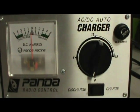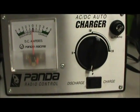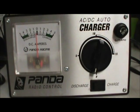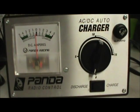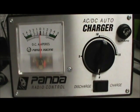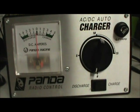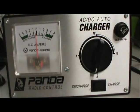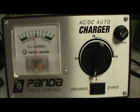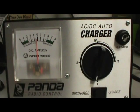The discharge and the charge. Anyways, this is what you can use if you have one of these kicking around, or even a plain adapter. I originally used an adapter — maybe a 12 volt, 1 amp adapter — and just put two alligator clips on it. If you don't have them in color coordination, just whatever starts bubbling is the item that's cleaning. So if your coin bubbles, you're doing the right thing. If it doesn't bubble and the fork bubbles, it's reversing — it's going to reverse the effect.